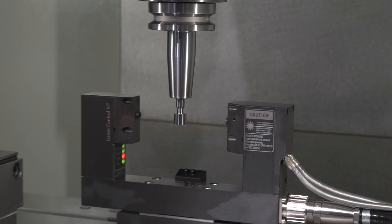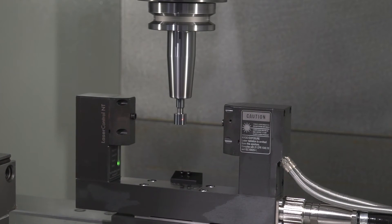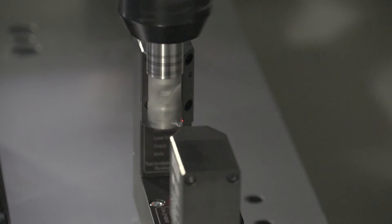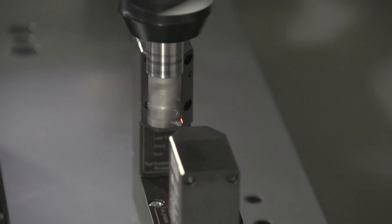The laser technology — what is it and how does it work? It's a system for in-process, accurate setting of the cutting tool. It consists of a unit based on a transmitter at one end and a receiver on the other, and the cutting tool, rotating at the speed that you're going to cut with, goes through the laser beam, shading it. We capture the axis positions and do all the calculations for length and diameter of the tool. The beauty of the laser is we're measuring at the cutting speed, so what you're going to cut with is what we're actually measuring — a true dynamic picture of the tool. We can also do scanning and form control of all sorts of tool geometries; the limits are endless, really.